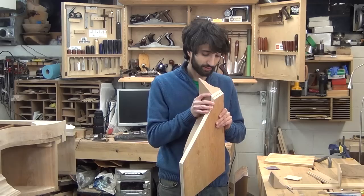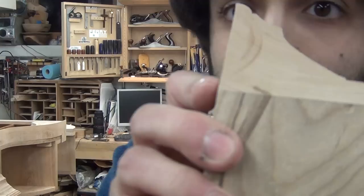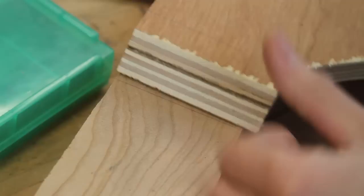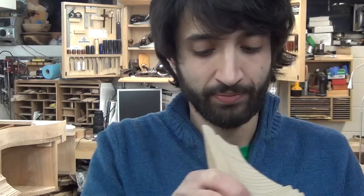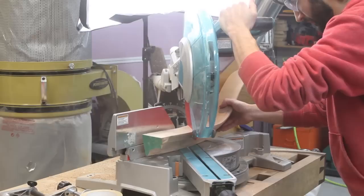Then I can use some double-stick tape to actually stick the molding to this little jig, aligning the cut here. I align the cut from my miter saw to the cut line — you can probably still see a little bit of the pencil line on there. There is a pencil line that I traced directly from the case, and I was able to just rest the molding right onto the jig, put this little edge right on that pencil line, then stick it down with the tape. Then I can take this whole thing to the saw and make my cuts — same thing on the other side as well. That's how I was able to get the miters cut on these.